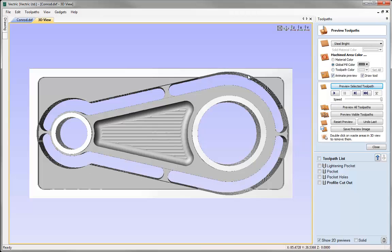As suspected, the tool did go into the wall there. This confirms it's always worth using the toolpath preview to get a clear picture of how your toolpath is going to function and what will happen during machining.